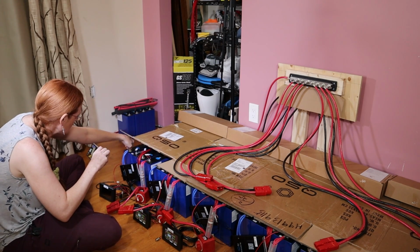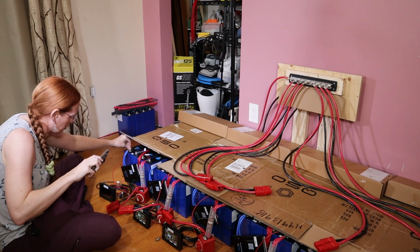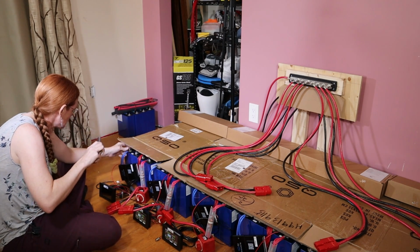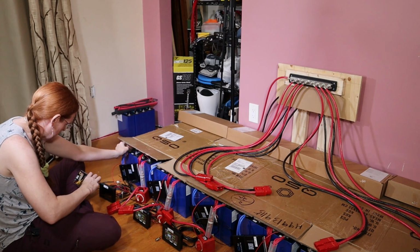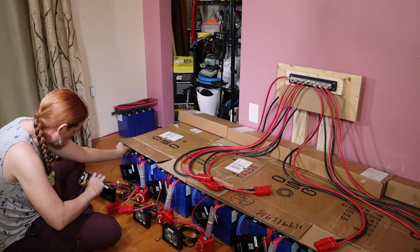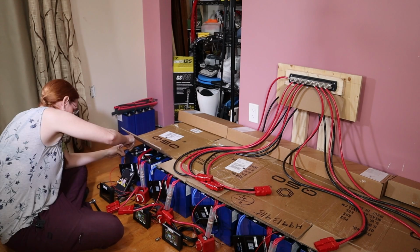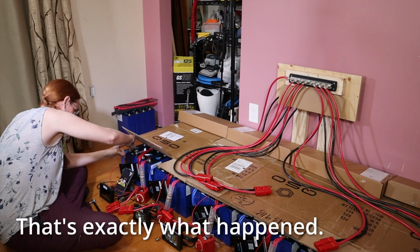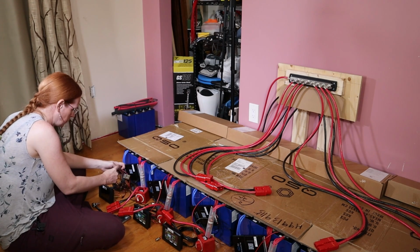Well, the thing is it didn't blow up right away. I was sitting there looking at the inverter charger, and it was probably 30 seconds to a minute later that I suddenly heard a pop. Now, did the screen come on? The screen was on until it popped. Now, actually, here's one thing. The screen turned off for a little bit and then came back on before it blew. You've got a diode in series with the input, so it wouldn't have reverse biased the positive. It's short circuit protected in the circuit, so I don't know why it failed.